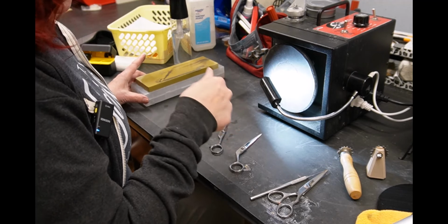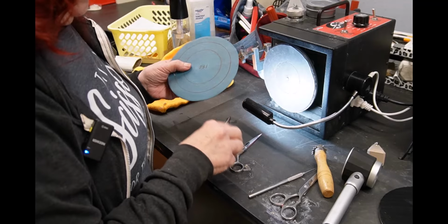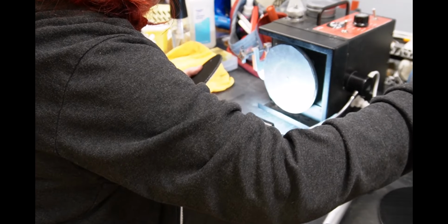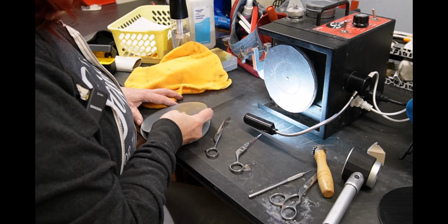Now, that metal removes so easy here. I was thinking about, when I was sitting down here, that I was going to use something really aggressive, like this 180 grit. But I don't think I need anything that coarse, because that metal removed faster than I was expecting it to. So what do I want to use? Feeling through all of mine. I'm more feeling than looking to see what grit. I'm kind of feeling what grit I want. Here's a worn 400 grit. That might be too worn, but let's try that one.